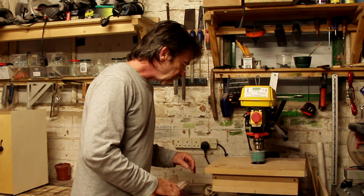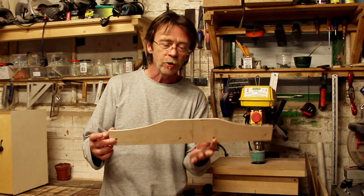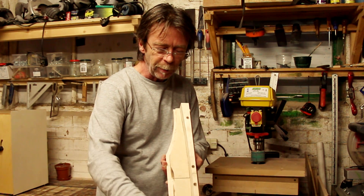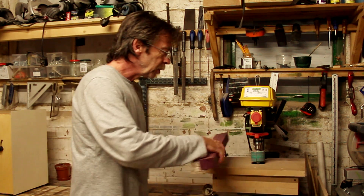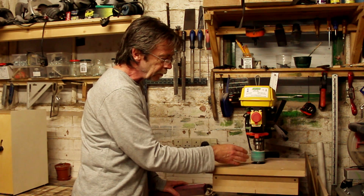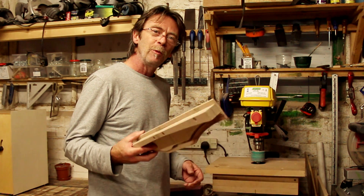We do this in two sections: first we put the back curve in, then we use a second template of exactly the same construction for the fades. The only difference with that template is the stopping plate at the back has the curvature cut out of it, so once we've cut the back curve, it fits snugly into that one and allows us to take the fades out. It's a very simple machine - just a box, a few discs and a bearing, with templates that need a little care to get to the right dimensions. Having done that, you can reproduce the same curvature time and again with a lot less effort than using a belt sander.